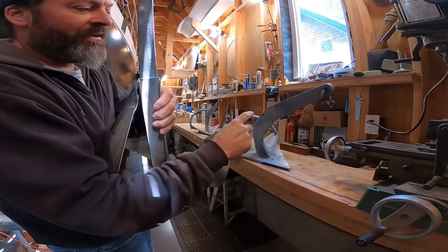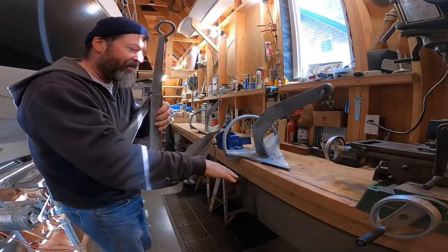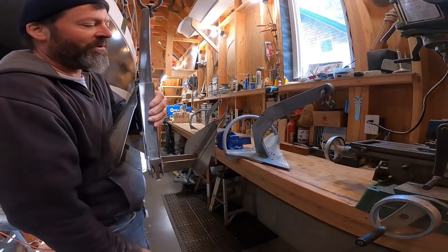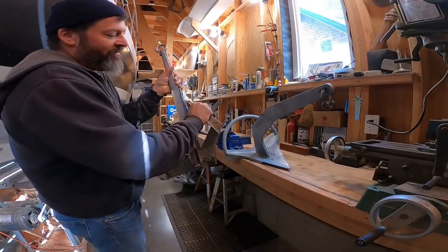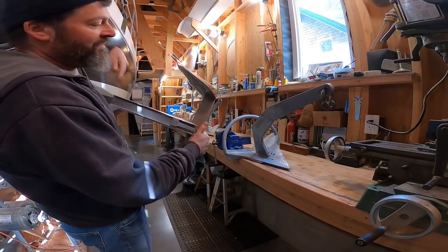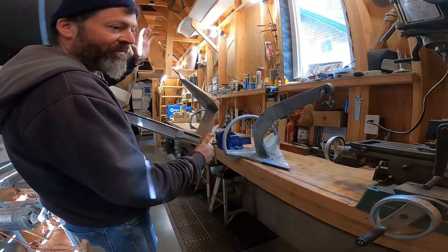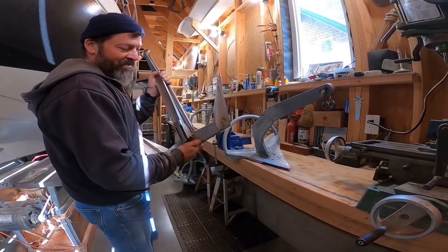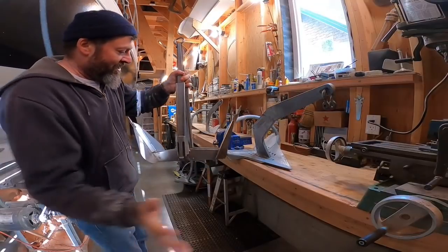It's very strong, very sharp, and when they're in the setting position, this is just pointing straight down just perfectly for penetrating weeds, perhaps other hard seabeds. Great anchors. They do have the problem of the lazy fluke often sticking up out of the seabed. It means that your rope can wrap around easily during wind shifts, and at that point the anchor will be useless. If it wasn't for that flaw, boy, these anchors might just replace all the others.